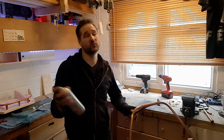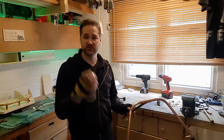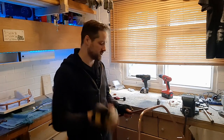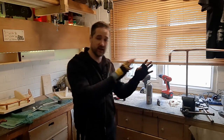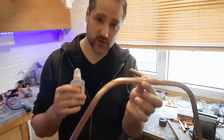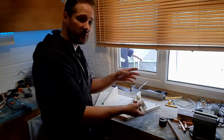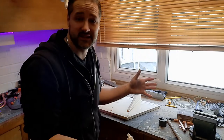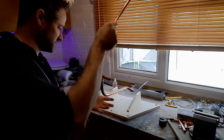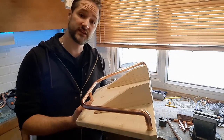I should be in a well-ventilated area, which I'm not — but I'm not going to do a lot of it. Just a light little dusting is all you need; otherwise it will start running. Don't forget to give it a good shake, give it half an hour to dry, and then we should be able to put it onto this. Now that the lacquer has cured on my copper, I'm going to put a nice healthy dose of glue into the hole — about halfway full — and this stuff takes about 24 hours to go off. Plonk it in and just let that dry and we'll be ready to install.